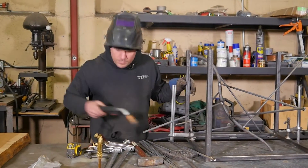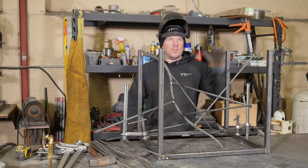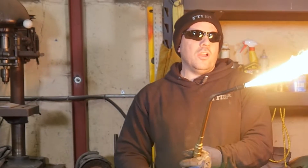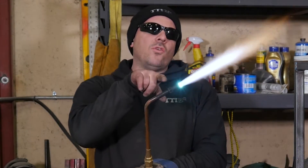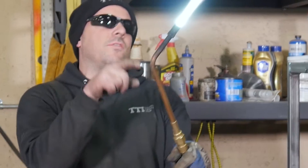Now it's about taking the oxygen-acetylene torch and bending the branches into the forms I want for the piece. When adjusting your torch and you turn on your oxygen, you'll see the flame start to turn more blue. Watch for the cones in your tip — you want them to look like small, even cones. When you adjust the oxygen to a certain degree you create a big cone, and you don't want that — it means you're not burning the fuel efficiently.